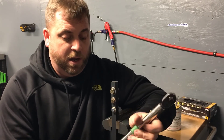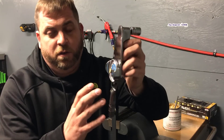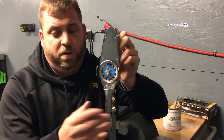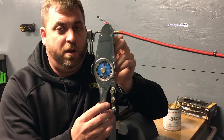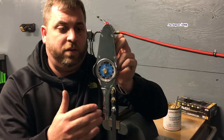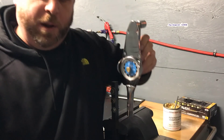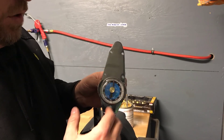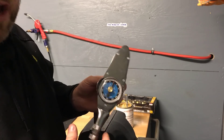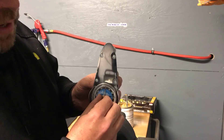The other style torque wrench I have here is more of an inch-pounds torque wrench. I use this for setting injectors when doing overheads on a Cummins engine — that's why I have it. Most new guys have never seen a torque wrench like this, so I'll show you how to use it. This style is called a dial style — or sometimes a beam style — torque wrench.